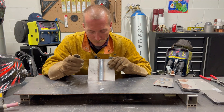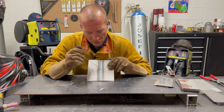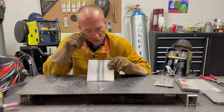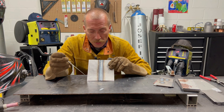We just did the thin stuff and it came out pretty good. I haven't wire brushed it or anything yet. Here we have a really flat bead profile, and I must have picked up along here because there's a bit more ripple that I'm used to seeing. Anyway, very minimal distortion, minimal discoloration — all in all, the pulse did its job. It did what it was supposed to do.